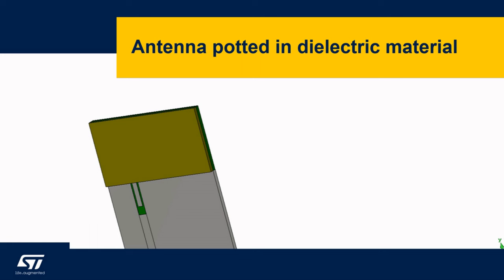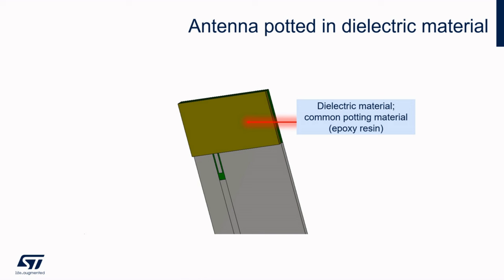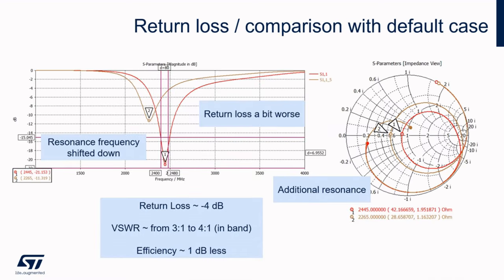Now we will investigate what happens if we pour epoxy resin on the antenna. It is a common case when we protect electronics from water and possibly shocks. This material directly touches the metal part of the antenna as well as the carrier material. This of course changes the conditions for which the antenna was originally designed. On the return loss plot you can see how the added material increases the resonance length and thus shifts the resonance lower. The Smith chart also shows that there is another resonance which is now lower in frequency. While the resonance is lower, the return loss becomes worse. The next resonance is certainly a multiple of the fundamental resonance, and we can see that the higher one is better adjusted — contrary to the basic one. This could emphasize the emission of harmonic frequencies coming from the transmitter. What bothers us most is the frequency shift caused by the dielectric, and thus also the adaptation of higher harmonic frequencies.